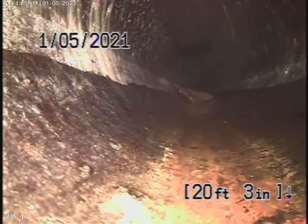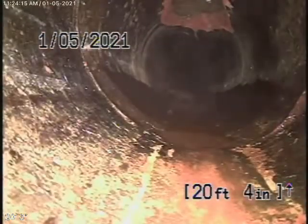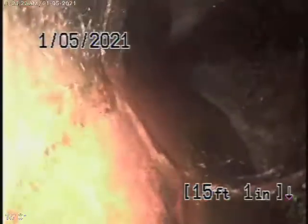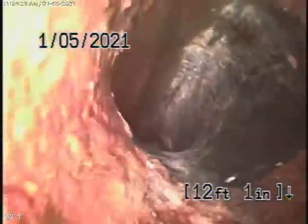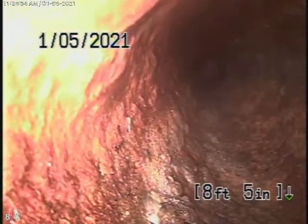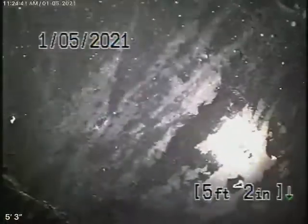We've located that. Now Alec, just pull it back real slow — see there's the hole in the pipe over there. Then that little piece of cast iron you saw in the line, that could be flushed out because it actually moves. It's going to turn and go underneath the foundation of the house. They left a little piece of cast iron, which actually doesn't look too bad, going underneath the foundation.